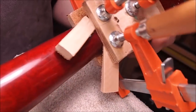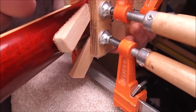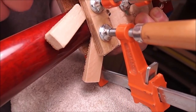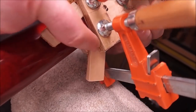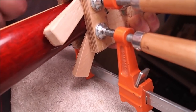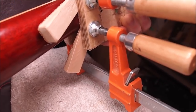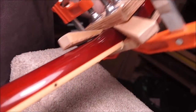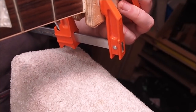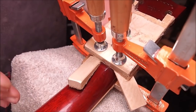Test run complete here. Some experimentation was necessary. It can be difficult to get them to close up all the way along the joint, especially in these - I call them double lobes - the ones that break off into two sections into the cheek area. Just putting clamps on a flat caul sometimes doesn't push them all the way down at the ends. So you see I use these wedges here - maple wedges with cork on the bottom of them to prevent denting the mahogany. I'm going to take a photo of this so that in the heat of the moment I know where things should be.